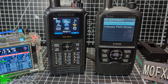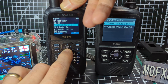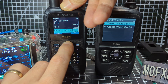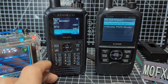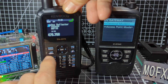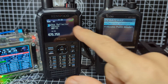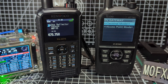Whether they work in exactly the same way I don't know, but to run the new DV Connect app, you go to menu, across to D, go down to DV gateway, turn on terminal mode — there it is. Select it, turn it to reflector terminal mode, then go back to the main screen with the menu button. A green 'TERM' appears on the screen, so now it's ready to be used with your DV Connect app by PA7LIM.